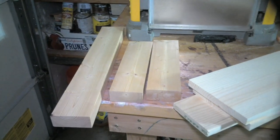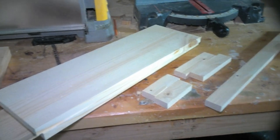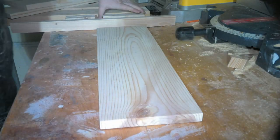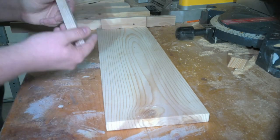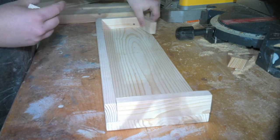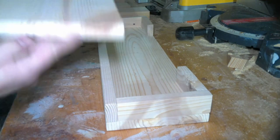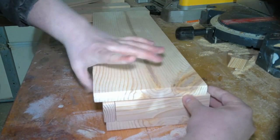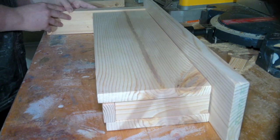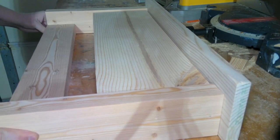Let's take a look at all our cuts that we made so far and see what we got. Right here I'm just going to be pre-assembling our product with all our cut pieces. The main reason why I do this is just to make sure there's no errors, or if I have to make additional cuts or replace something. It also gives me a chance to determine which side I want facing out versus facing in, depending on the boards and their flaws.